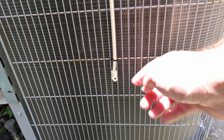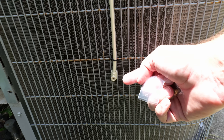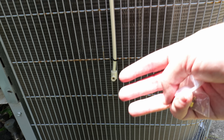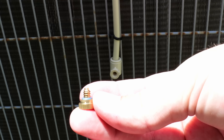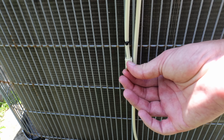Now that all my lines are run, I want to make sure the nozzles are pointing out away from the condenser. Some people might think they should point toward the condenser so water goes directly onto the coils, but we actually want the mist being pushed away — the fan will suck that cooler air in. The idea is not to put water on the coils themselves, but to cool the air on the outside of the unit. These brass misters are super easy to install: they're threaded on top, so just put them into the port and twist clockwise until nice and tight. Do the same on the remaining two lines.